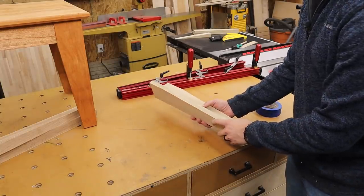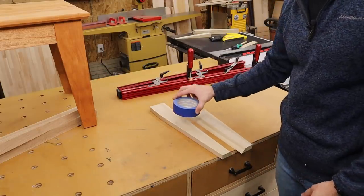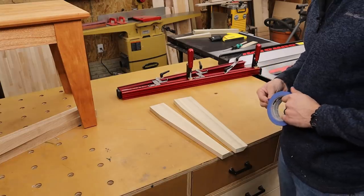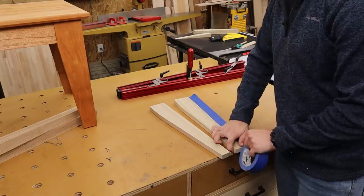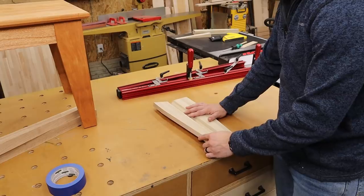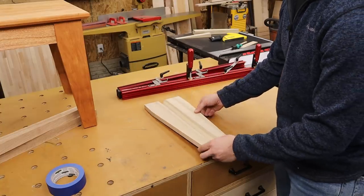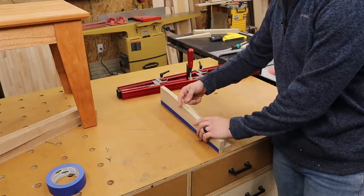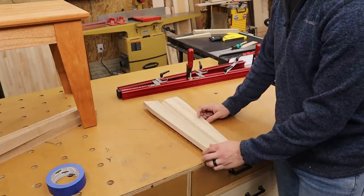Now that the pieces are cut, we've got to glue up that mitered joint. What I did on this coffee table was use blue tape and glue — no clamps. I flip one of the legs over, put blue tape along that mitered edge, then flip the workpiece over and line up the other leg against it. With the tape acting as a hinge, I can open the leg up, spread some glue inside, push it together, and add more tape to apply a little more pressure. Let that sit for a few hours, then take the tape off, clean it up, and you have your coffee table legs.